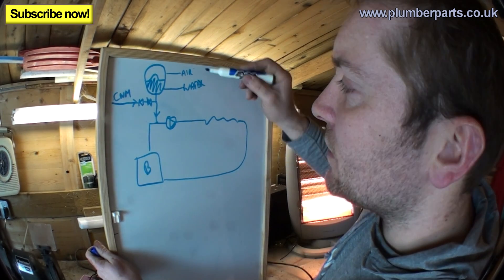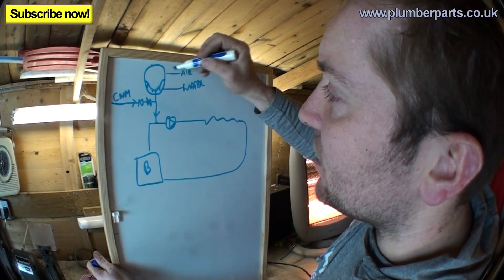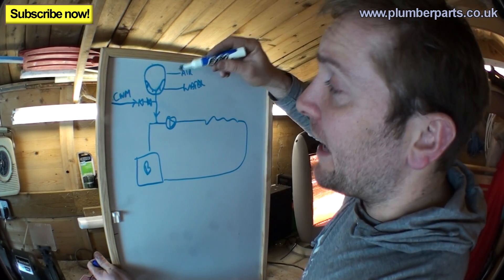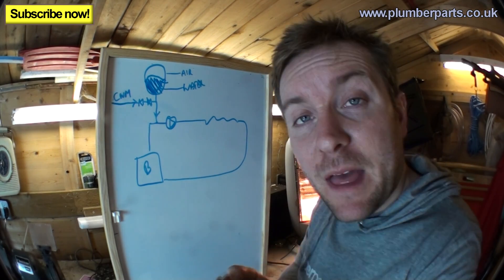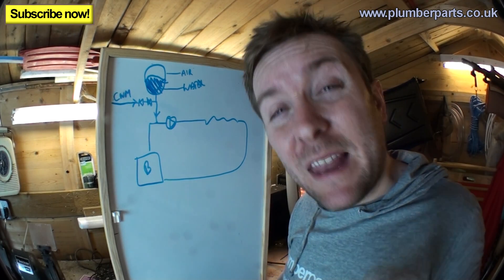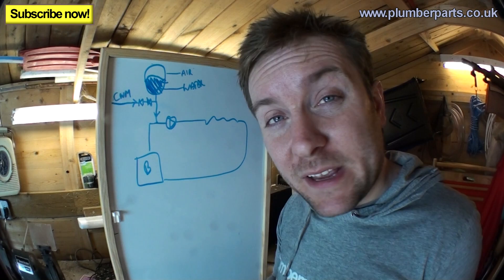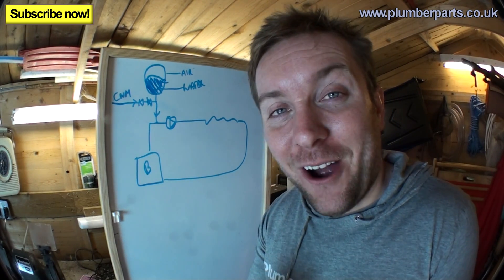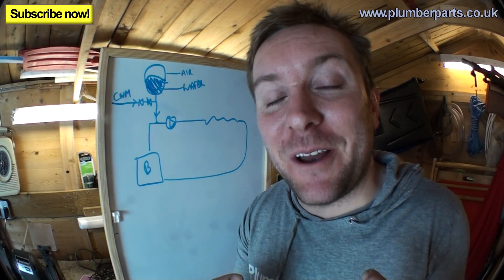So there's our diaphragm - we've got water on one side and air on the other. When the system is cold, this is all air on one side and water on the other. When it gets hot, the water expands up into the air side and that takes the expansion - therefore you don't have any problems. We have covered this in another video about pressurised heating systems - I'll leave a link to that in the description below. Let's go and have a quick look at what one of these looks like when it's piped up. And I should mention - the installation I'm about to show you was not me. It's absolutely dreadful.